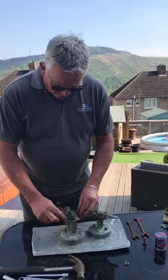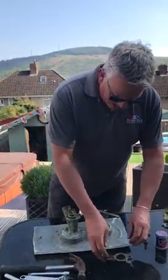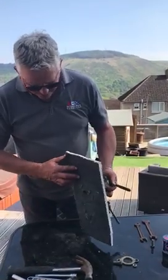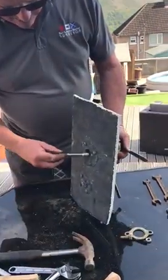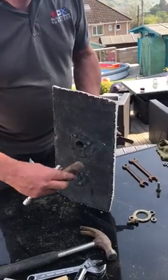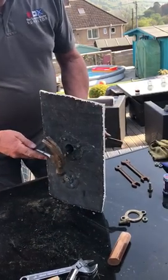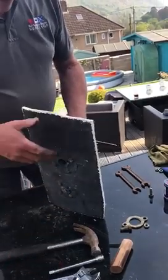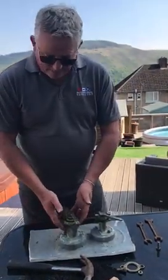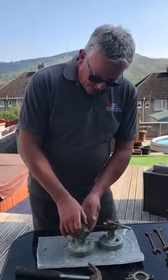Undo these and get them off. This collar is quite important — there's an open and shut, which I'll come to in a minute. To get this valve out if it's seized, you need to go outside the boat and try and get some sort of drift. My dad used to prefer using a wooden dowel. Put a drift in and very gently tap it with a hammer. If it doesn't start to pop up, you need to take the hoses off, take everything flammable away, put a bit of heat round it, put a bit of penetrating oil around the top of the collar, and come back later — or use a bit of heat to try and free it off.